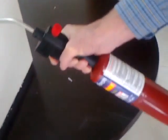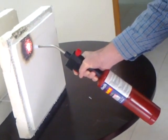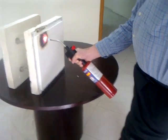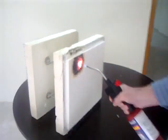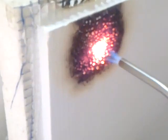The no-fire fire-retardant coating will expand to about maybe 50 to 100 times its original thickness. I should be able to put this amount of heat — 950 degrees C — on here for well over an hour, and the hope would be that the substrate will be protected and the styrofoam will be protected.